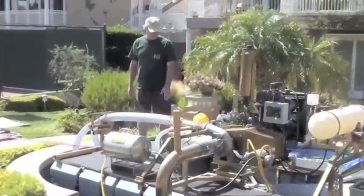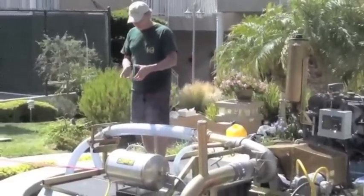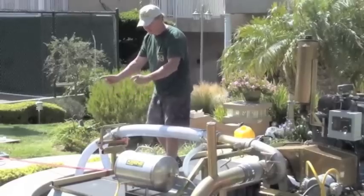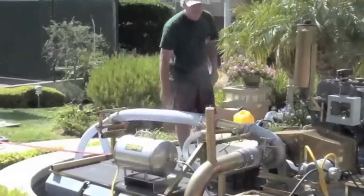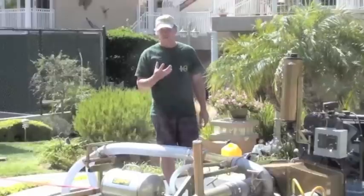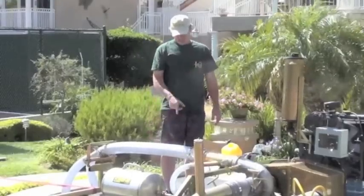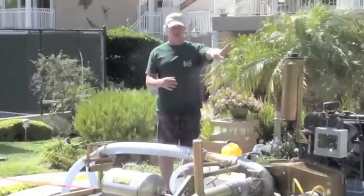Let me talk about the pressure hose and pump. We are coming off the pump with a four-inch pressure hose discharge. Over at this end, we have a four-inch by three-inch by three-inch splitter. So we're coming out with two heavy-duty pieces of three-inch pressure hose going down underneath the deck and into the power jet. We also have another Y-splitter, which allows you to pull full pressure and full velocity off the pump. This pressure hose is used to power a smaller two-and-a-half-inch or three-inch suction nozzle that I'll show you in a few minutes.